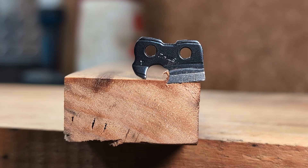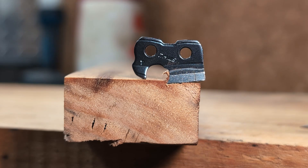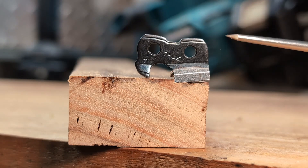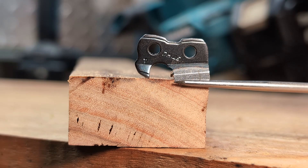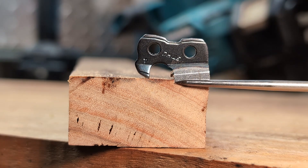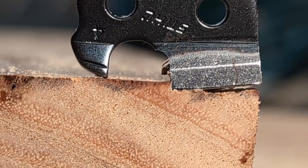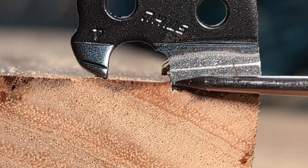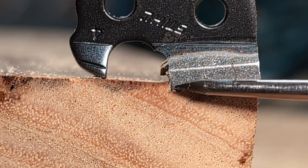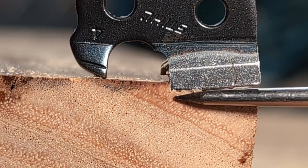I'll file this into a different shape and try and drive it back into the wood so we have something to compare. Now I've square filed it to approximately an 85-degree side plate. As we can see, I've reduced that side plate angle. Because of that, it is now trying to break the chip out a lot sooner rather than having that leading edge buried deeper into the wood - it's now breaking it off as it hits. You can see that when the leading edge is hitting the wood, the entirety of that side plate is severing those fibers almost instantly. Instead of building up a small section in front and starting to peel it up and out, it's doing it in one motion.